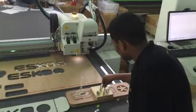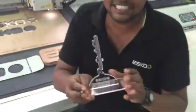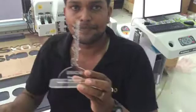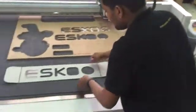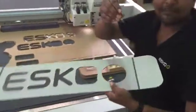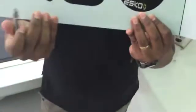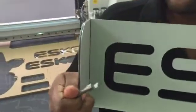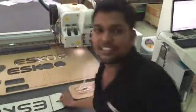There are some special bits as well. One of them is the acrylic etching bit — this is the etching bit and you can see the etching that's happening. The other special bit I use is a folding bit. In the case of ACP/ACM aluminum composite, when you want to fold, you use the folding bit for this purpose.